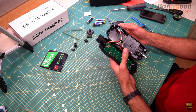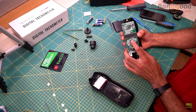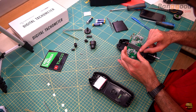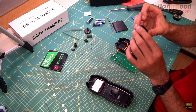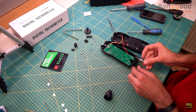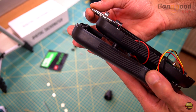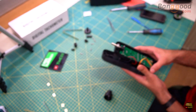Now let's take a look inside. It's a pretty simple device. Inside the plastic housing there is a single circuit board with integrated selection and memory switches. On the front we can find the laser and receiver diode. There is an Atmel microcontroller and many resistors. Inside the lens is just protective glass, probably to prevent ambient light from disturbing the receiver diode. On the bottom we have the contact measurement axis with a fairly large bearing. On the end of the axis is a plastic part with 3 grooves, and on that position on the circuit board there is one transmitter and one receiver diode that count pulses. With this design we get 6 pulses per round, which is why contact measurement responds faster than laser measuring, which needs at least one full round when using a single reflective tape.